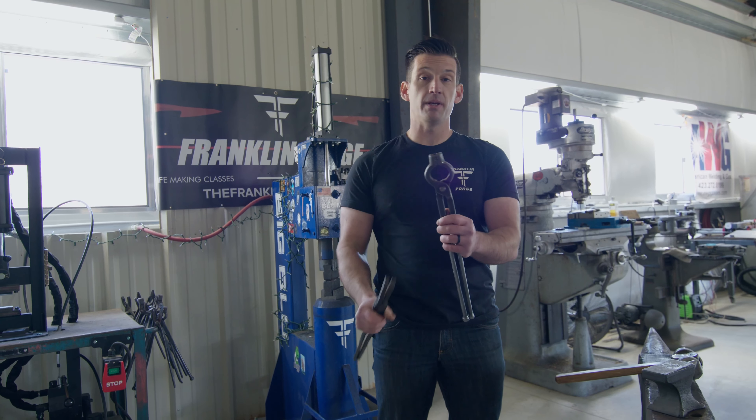Tip number five is where to source your steel. That's a question I had when I got started — it's actually how I met my mentor Jason Knight, because I sent him a message having no idea where to get high carbon knife steel. I specifically use quarter inch by inch and a half stock, which can forge a lot of different things — smaller knives, chef's knives, cleavers. Some of the places I like that are very accessible and ship fast: Pops Knife Supply at popsknifesupply.com, onlinemetals.com, and New Jersey Steel Baron. Once I discovered those, that was it.